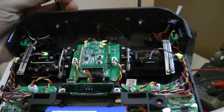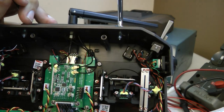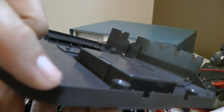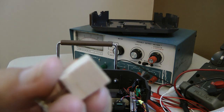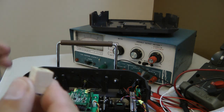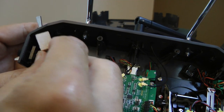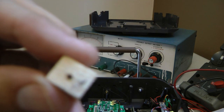Now, when I drilled the holes, I was worried about when you put the back on. There's a ridge on here, and this ridge goes in the case a bit, so I was worried about the switch possibly hitting that ridge. So I made a balsa block, which is the same dimensions as the switch, and then using that, when the switch was not in the case, I moved it around to get some ideas of clearance and where it could go. Once I found the right spot, I drilled a hole dead center in the balsa block,